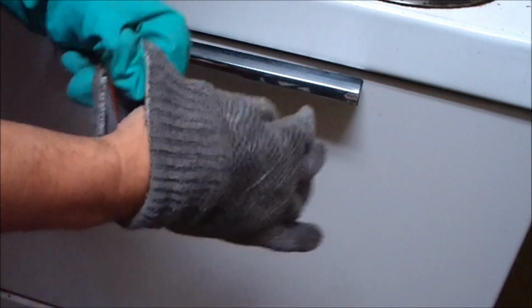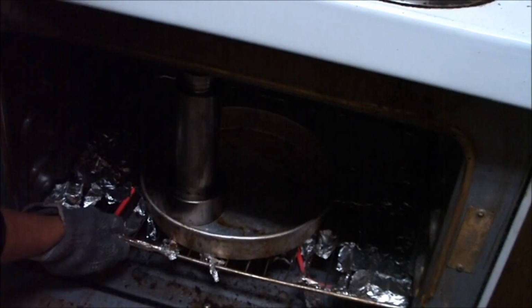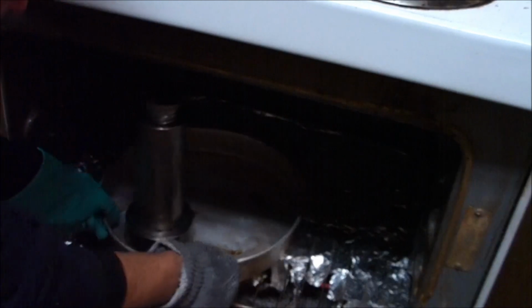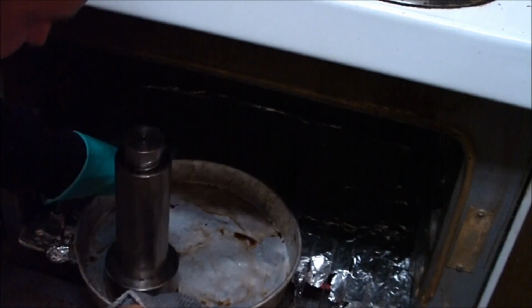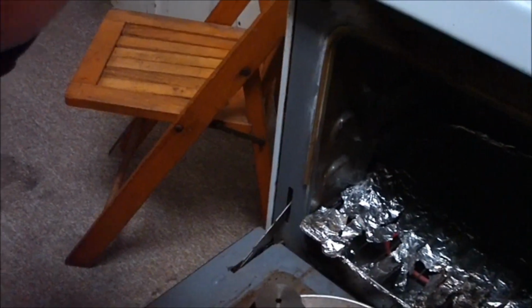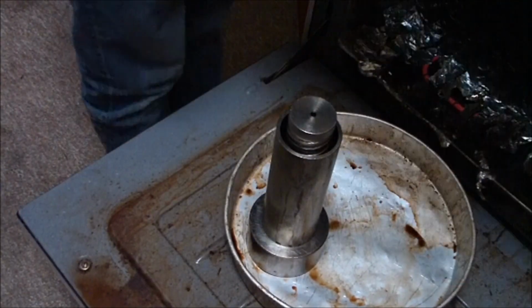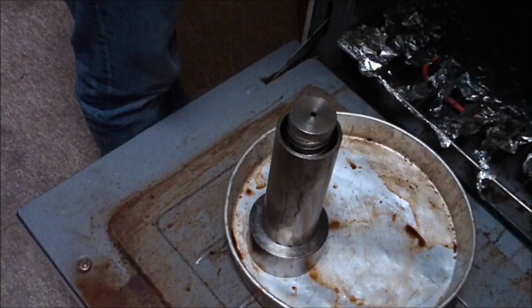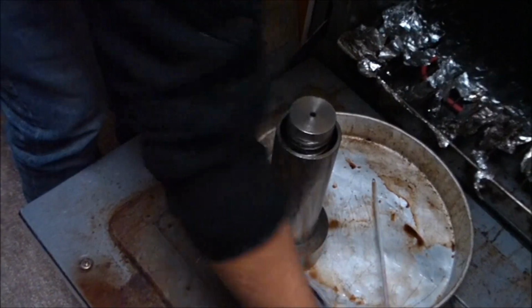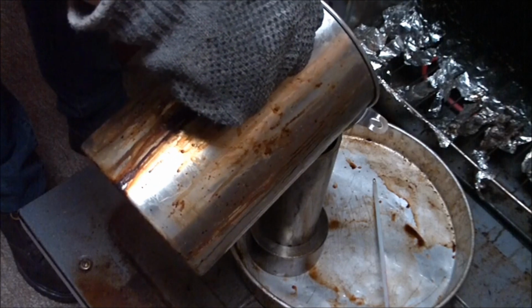Okay, so we have our wax up to 410 degrees, which is our molding temperature. So we will be getting the mold out of the oven slightly, just enough to pour the wax in the mold. It's pretty hot. So we're going to pour the 410 degree wax into the mold. There is our thermometer, and our strainer. This is original Edison brown wax.